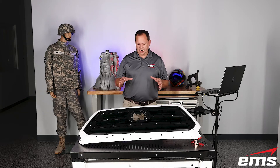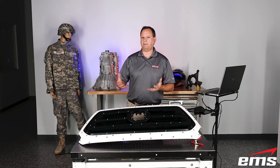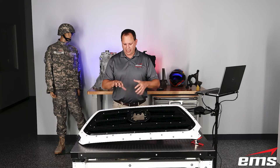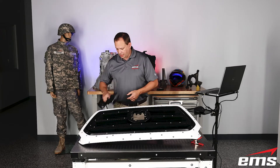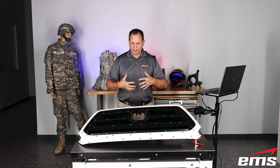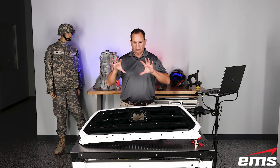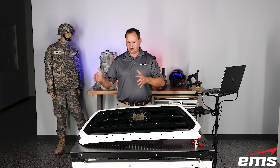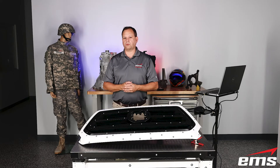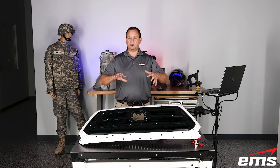So now we're set up for our second scan. I've really torqued the part — lifting it up here and there and clamping it down — so we're probably exaggerating how much it might actually be out of shape. But with a scanner like the HandyScan Black, which has an accuracy of one thousandths of an inch, even slight deviations we're definitely going to pick up. What we're trying to do is look at this part through different stages — it might get checked on a gauge or checking fixture in perfect body position and all check out, but then as we assemble it with different parts and put it on the vehicle, that's where things could go wrong. If we put these targets on and leave them on through those stages, we can check every point along the way and see what's happening — is it deforming?